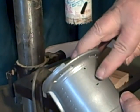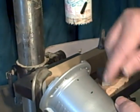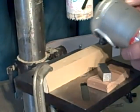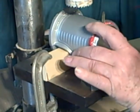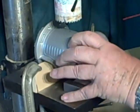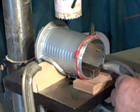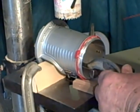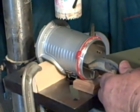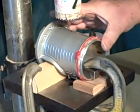See these marks? This is back one inch from that mark, which means I'm going to cut a two inch hole in there, and this will be my center. This is the center of the casting, so it's got a nice line there for you to follow. I'll put that on there and slide it so that it's in the center, right on that dark mark that I made there, and I'll re-clamp this. Now that's plenty snug — it's not absolutely perfect, but it's plenty snug enough to be able to get in there and cut that hole.